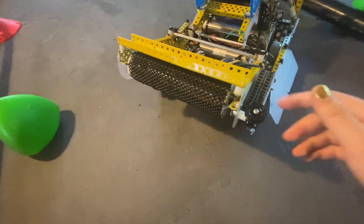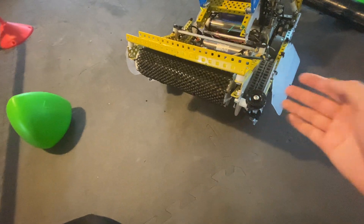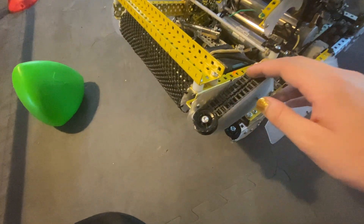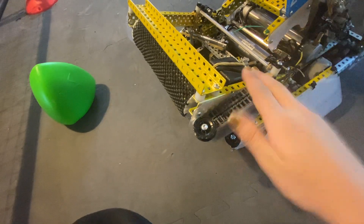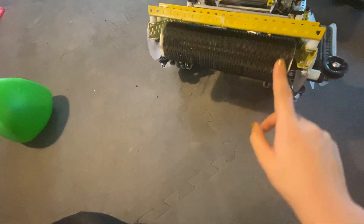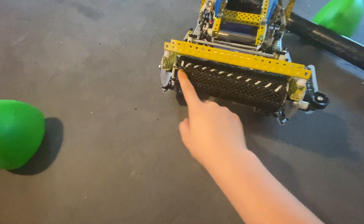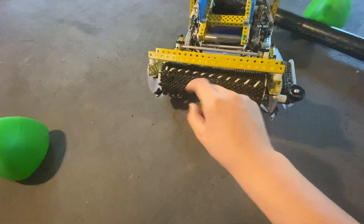Next is our intake. We have a pulley on one side just to act as another wall rider, because without it this little poly piece can actually get stuck in the wall. We ran 900 RPM double-chained — the double chain was just there to prevent a single-point failure. We ran a mesh intake with Delrin cutouts and laser cutouts, with 117B rubber bands across it, and tied together the mesh with some string.